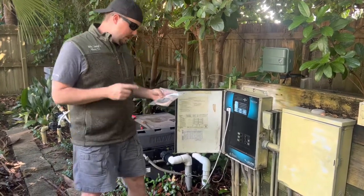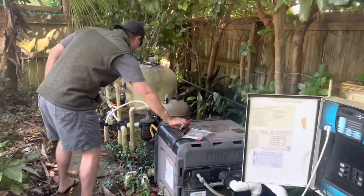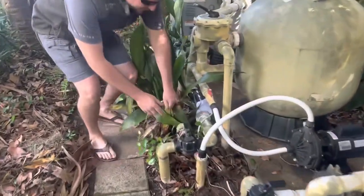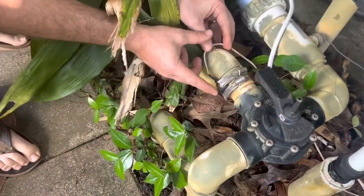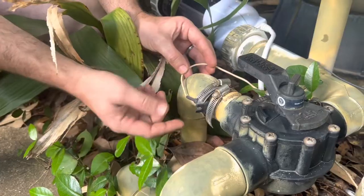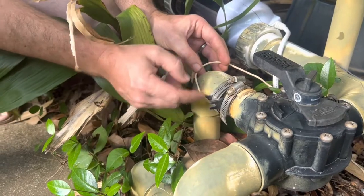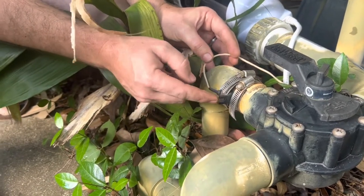The first thing you want to do is locate your temperature sensor. You're going to come over and find it clamped onto one of your pipes — it's just a little black thing. If it's an outside air sensor it might just be hanging over by your pool's control panel, but if it's checking the water it's going to be in here. There's a hole drilled and it's in there, clamped on with a pipe and a washer.